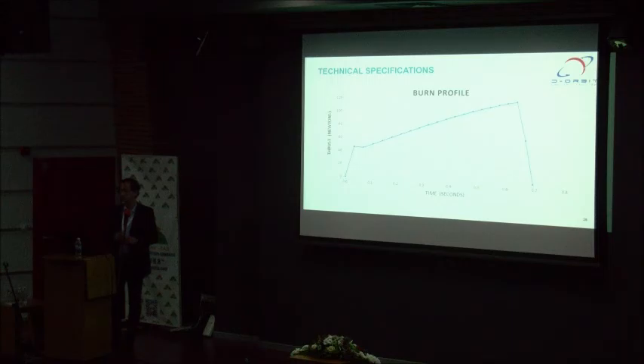If you fire all four, you have about 308 N of thrust in 0.7 seconds. If your thrust vector misses the center of gravity by just 5 mm, the satellite will spin up to 4,200 degrees per second — so the misalignment issue is significant and must be addressed. In that case, we recommend using a spinning wheel that begins spinning before the burn in order to ensure the firing does not provoke any undesired trajectory.